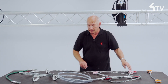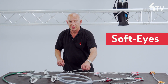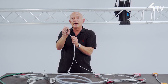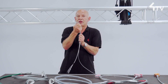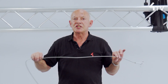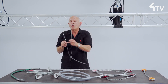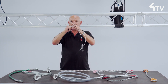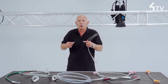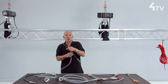It is possible to make slings without thimbles — so-called soft eyes. Of course, this increases the risk of wear and of weakening if passed over a small diameter item. There have been calls for these to be banned from our industry, but they do have the advantage of being able to pass through smaller openings — for example, when we need to rig above a catwalk floor with a fine grating. Pre-use inspection is important here.